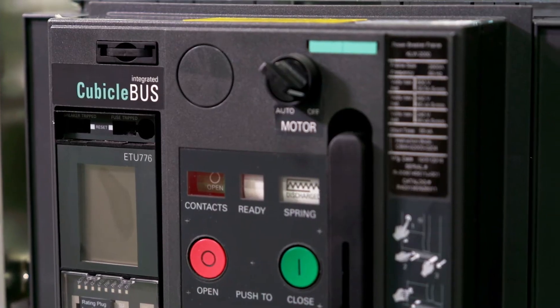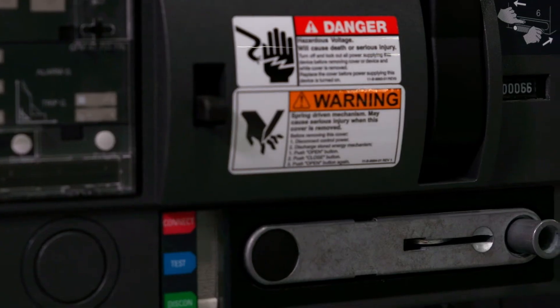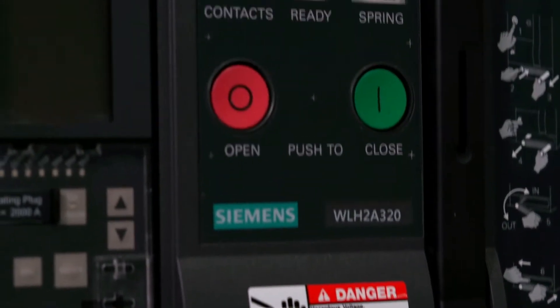We use that in every application. We replace a large number of old, obsolescent medium voltage breakers. In low voltage, we want to take the same philosophies. The modern low-voltage breaker that Siemens produces is the WL circuit breaker, and we use that as the core operating mechanism of our breakers. We've redesigned the primary so they rack directly to the existing bus of the older breakers.